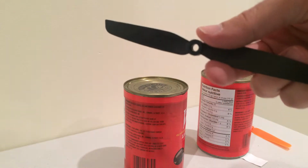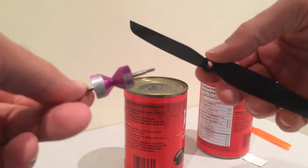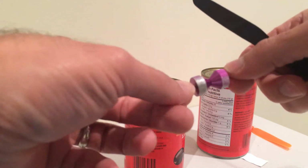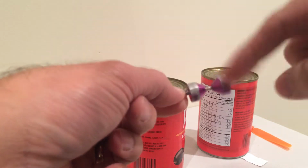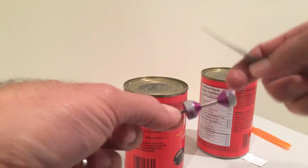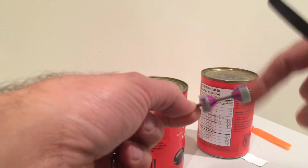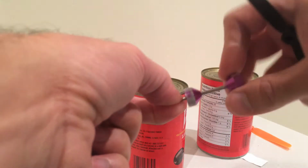Maybe not as good as he's doing it, but I'm going to share with you the way I balance my blades, and it works for me. So we start with this little thing, and he also explains how to basically balance these little wheels here that you need to have absolutely balanced, or else this is not going to work. So I just took a grinder to this and I tried to balance each individual wheel as much as I could. And so let's get this process going here.